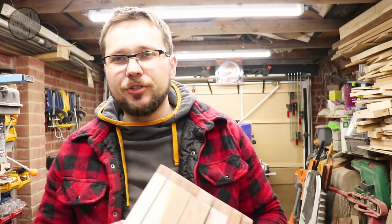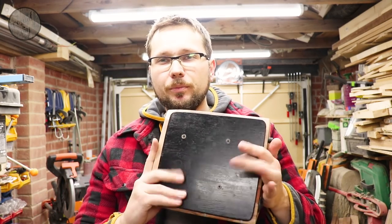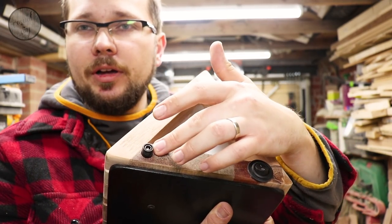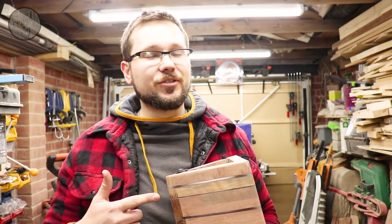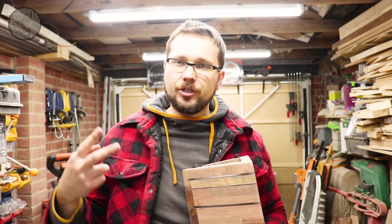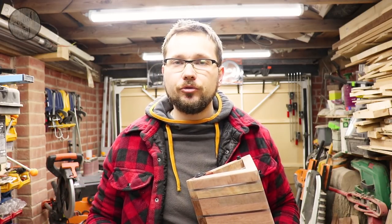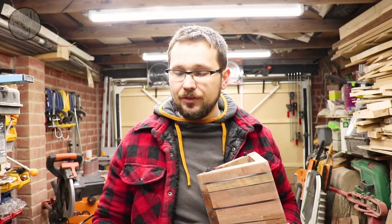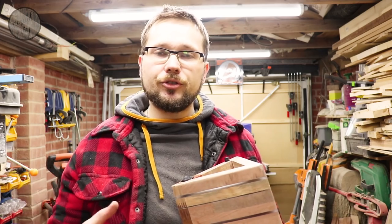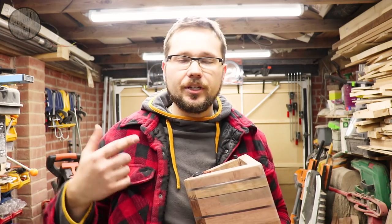The main construction and build is finally finished — sanded, base on, LEDs fitted, on/off switch and power insert in place. Now it's time to apply some finish. I'm going to use two coats of shellac, sanding between coats with 300 grit, and then as the base finish I'll apply two coats of briwax and buff it to a nice satin sheen.